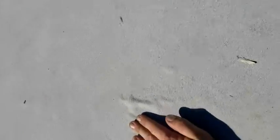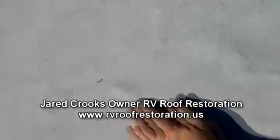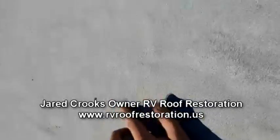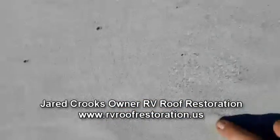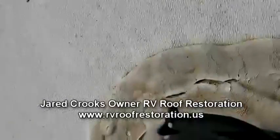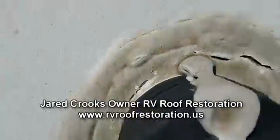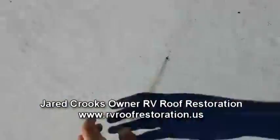That's the process of delamination. That starts when moisture begins getting under your roof membrane. It's hard to see, but we've got a lot of these bubbles starting to form all over the center of the deck membrane, and it probably came from right there — that big gap.